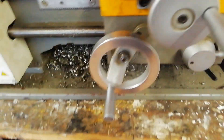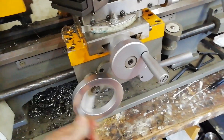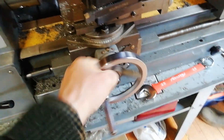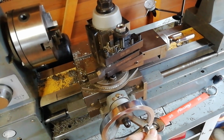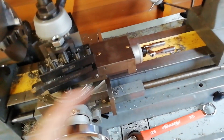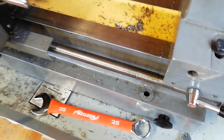The biggest difference for me is that on the lathe I'm accustomed to using, this big wheel moves the saddle up and down the bed, whereas on this lathe a similar big wheel located here moves the saddle across the slide — the cross slide. That's quite difficult to get used to. There is no similar wheel for controlling left-right motion; that's done with this handle here, which would normally be the lead screw for screw cutting.